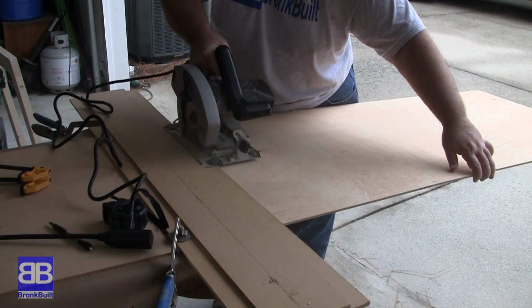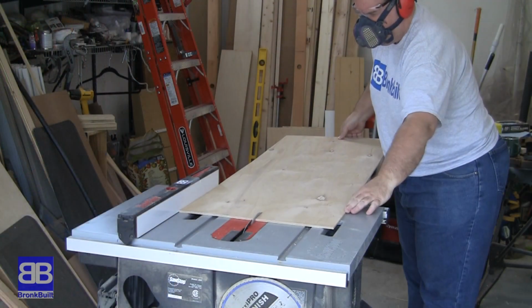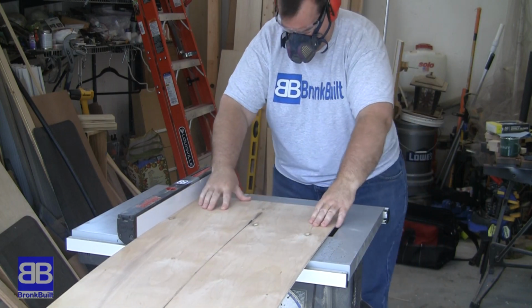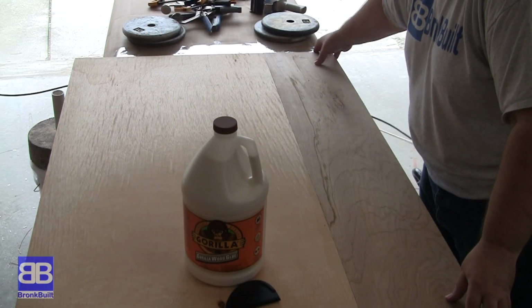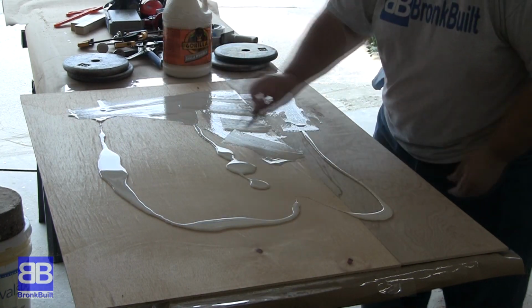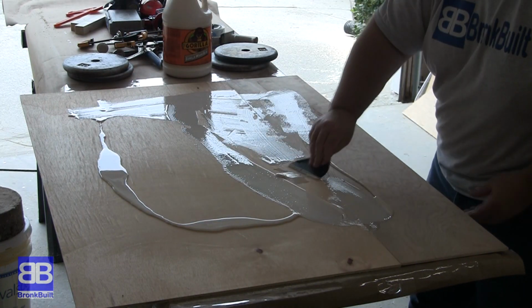I have some leftover 3/16 inch sheets that I want to use for the back of my cabinet. Unfortunately, none of them are wide enough, so I ripped different sheets so that I can put them together for the width I need for the back. You're never going to see this, so I was not worried about having a seam.